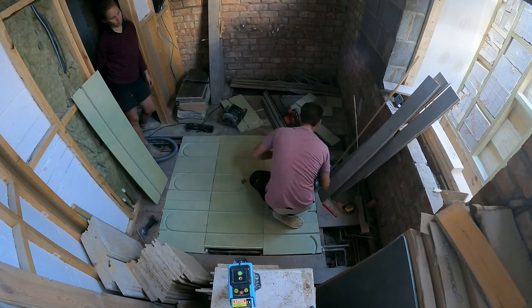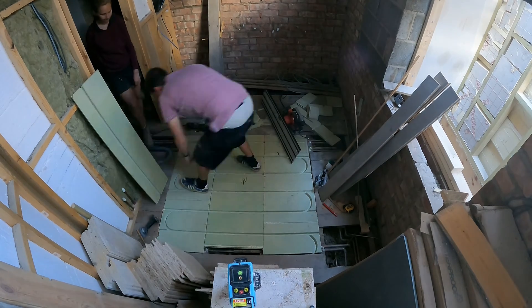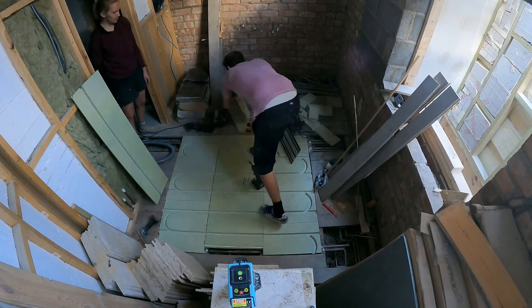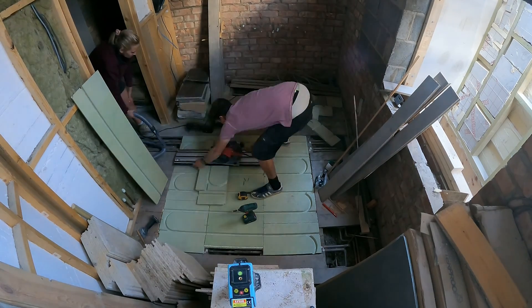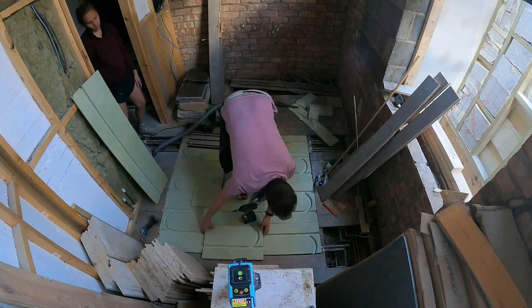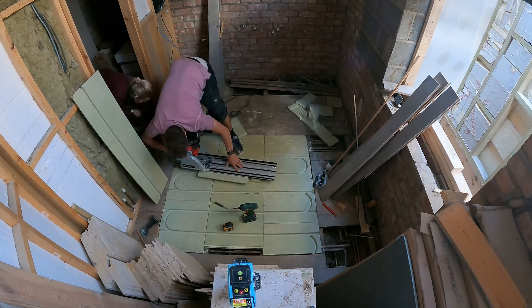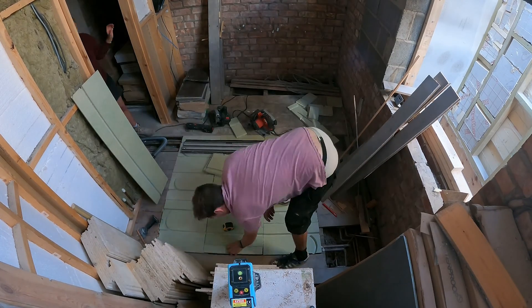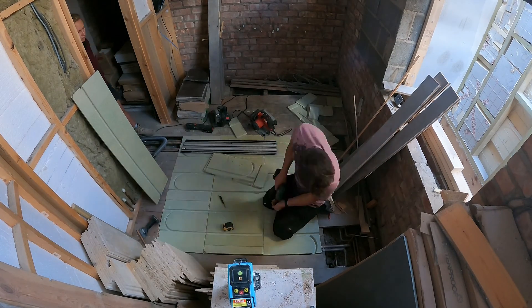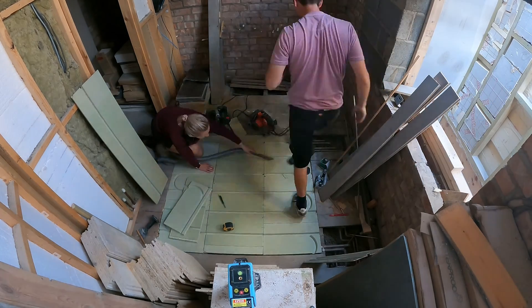What I actually do is lift all the boards, then glue them down to the joist with D4 glue, and after applying the D4 glue I screw the boards back down to the joist. What you've got to be careful of when screwing anything down through joists is what is actually in or over a joist — if someone previously has chiselled out part of the joist to allow cables or pipework through, just be mindful of that.